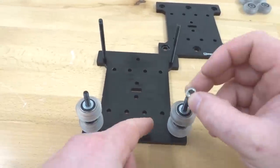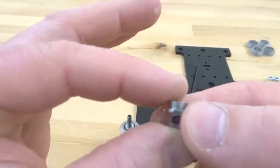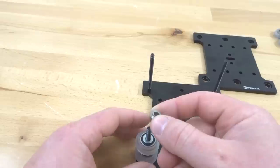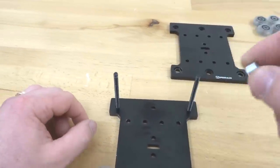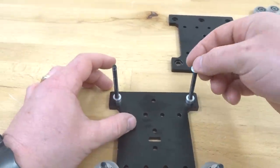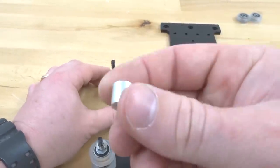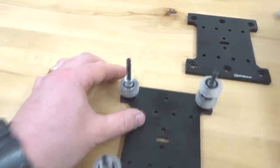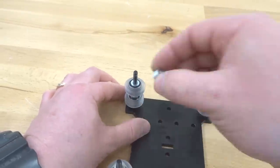Add the additional wheels on top, followed by our precision shims and our eccentric spacers — once again, the marked end should be facing you. Since we're going to be stacking these plates together, make sure this under lip is facing upward towards your plate, so it can lock into place and be adjusted from there. For our fixed wheels, grab two of your 6 millimeter aluminum spacers and place those on top of the screws, followed by our precision shims and assembled wheels. Then our 9 millimeter aluminum spacer on top of the wheel, followed by an additional wheel for each screw, and our precision shims and 6 millimeter aluminum spacers on top.